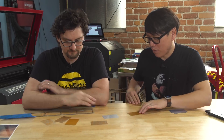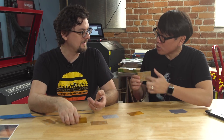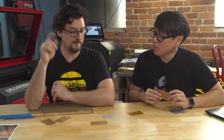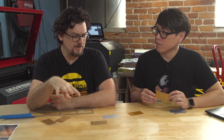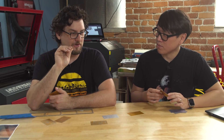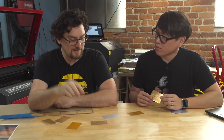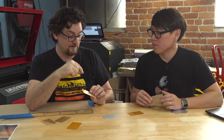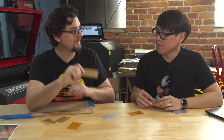On my test cuts I noted power settings. With an anodized coating it's a fairly standard thickness — it's the anodized layer you want to remove to get to the actual metal. There is an anodized metal preset in the Universal Laser Systems material database, and I found the base setting was pretty good, but I ended up increasing power by about 20–30 percent because it burned off a little cleaner and sharper. That also improved edge quality. The other thing I did was make the outer burn area slightly oversized — bigger than the card — so there were no remnants or slivers and the whole thing burned cleanly. This is also one of the benefits of a 60 watt laser: rasters that would be time-consuming on hobby lasers were pretty quick.